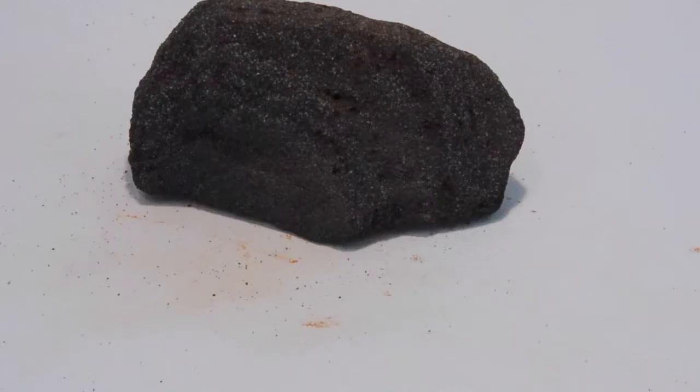These rocks have an iron grade of between the high 20s to low 40s, which is comparable to the banded iron formations found in Western Australia and other parts of the world. Where this rock is really different to those banded iron formations is in the ease with which we can separate the magnetite from the silica and turn it into a high iron product of high 60s.